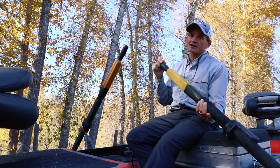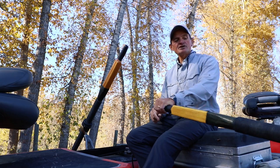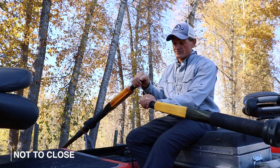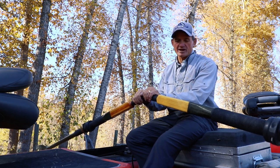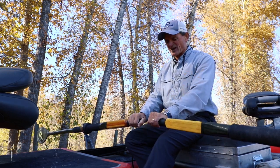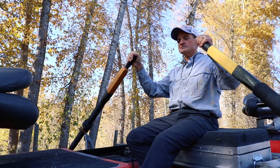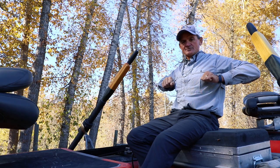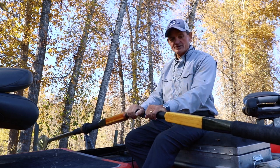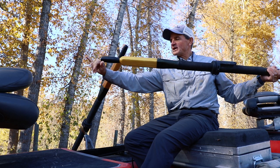These are wonderful, amazing, counterbalanced oars. I started using these so my son and my daughter could row — you can use them with one finger. But you still need a little bit of swing weight out there, just not too much. We also don't want them too close, because then you're going over and if you wrap your thumbs around the outside, you're going to bust off your knuckles pretty bad. You want those things about 3.5 inches when they're dead flat. That's going to make them come away from your body when you're rowing back. If they're too tight, it's going to come too tight to your body; if they're too far, you have no power. You can adjust your towers and the distance from the tower and the oar lock to get the right spacing.